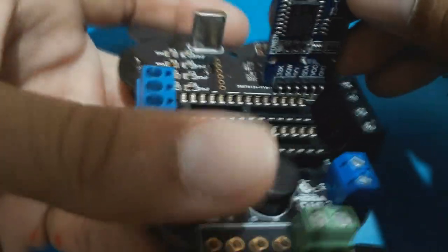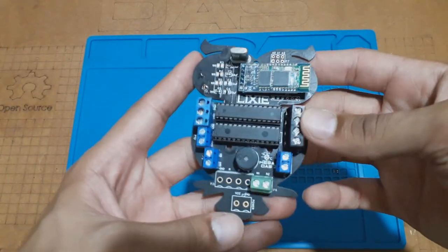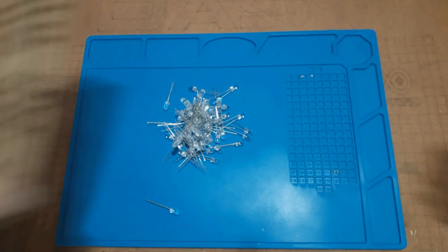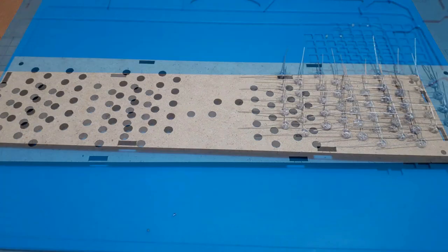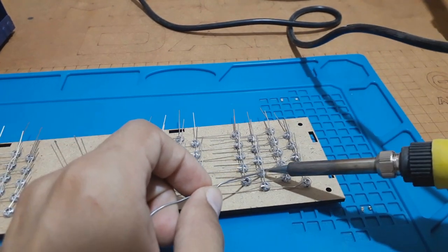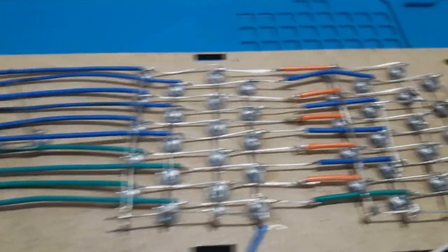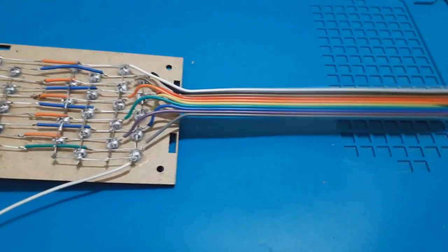About the RTC components, you can solder them directly or you can buy an RTC module and use it through the connector over here. Now we have the PCB ready and all the components soldered very well. Moving to the second part of the hardware assembly, which is the LED connection. We have a hole for each LED, so just use some glue to place the LEDs, then solder all the anodes of the same rows together and the cathodes of the same columns together. You will have 14 wires for the matrix, so just screw them as indicated on the PCB.